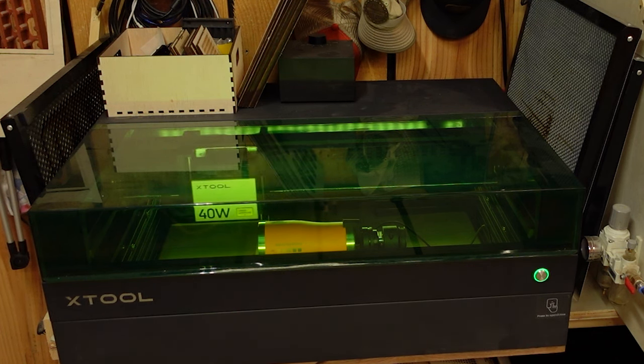And good burn, especially considering the speeds that we ran. I don't have a whole lot of lines in it, and I ran it at 100 on the LPI, DPI, whatever they call it in XCS. So there's always room that you could run that up a little higher if you wanted to.